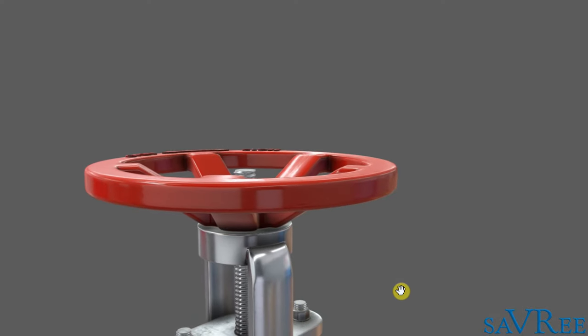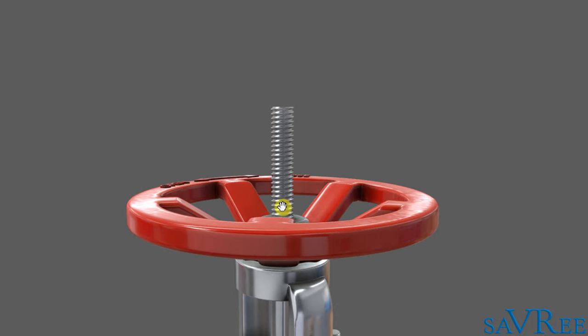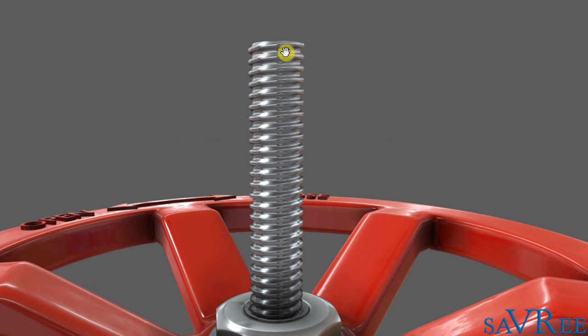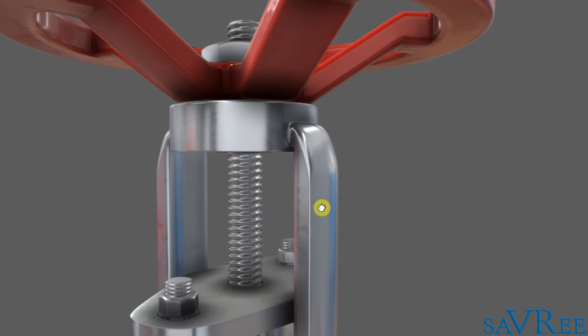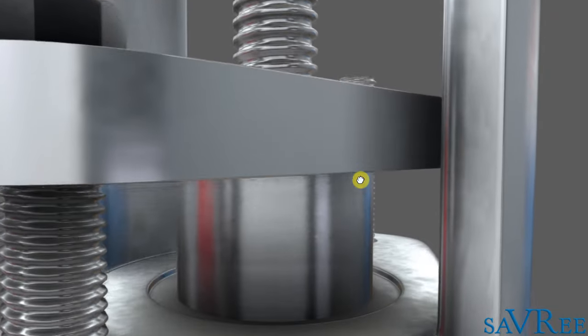Let's zoom out and we can see the actuator has been turned to the left. The valve is now open, and the stem — this spindle or long screw shape — has come out the top. This is known as a rising valve because we can see the stem has risen out of the valve. Going back the other way, the valve is closed, the hand wheel is turned to the right, and the stem has gone back into the valve. The stem comes down continuing into the main valve body.